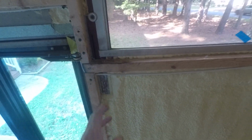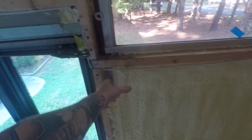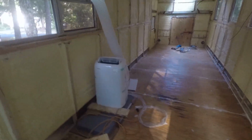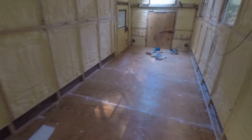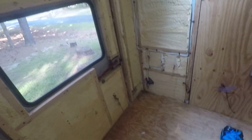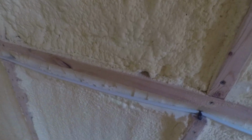I'm doing the DC first, so I need the DC switches here, and I need to run them all the way to the back because the back is where I'm gonna have the batteries, inverter, and, you know, fuse boxes. Everything is gonna be in this area over here. So I need to run that just like I ran these, the turn signal cable when I rewire those.